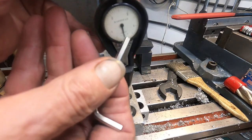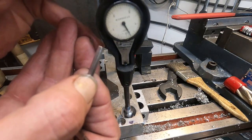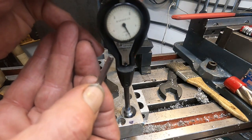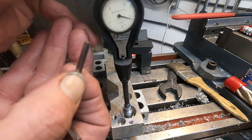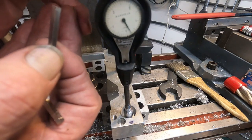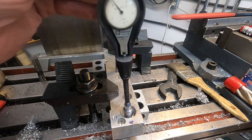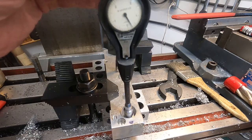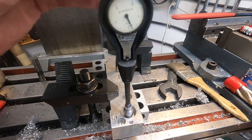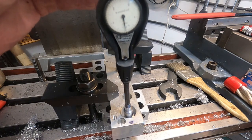Now 0's right at the bottom here. Let's raise it up some. See, that's showing about a tenth more. But you got to make sure everything's centered. See, that's showing a little tight, but it'll burnish in, see? We'll work it a little bit. There we go. So I'm measuring it, rocking it towards me, keeping it centered. Just about minus a tenth or 50 millionths. But it reads within 2/10.